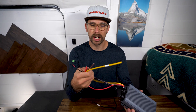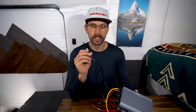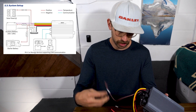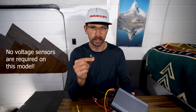All of these cables are actually nicely labeled. The yellow one is your PV positive — your positive cable for your solar. The black one is your negative connection. The brown one is your output positive connection. And then the red one is your alternator connection. You also have a little port to plug in your temperature sensor.